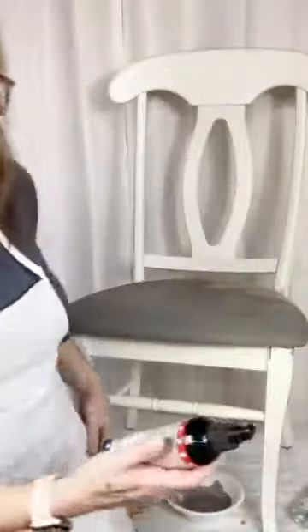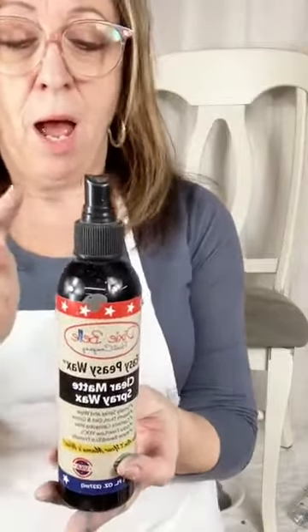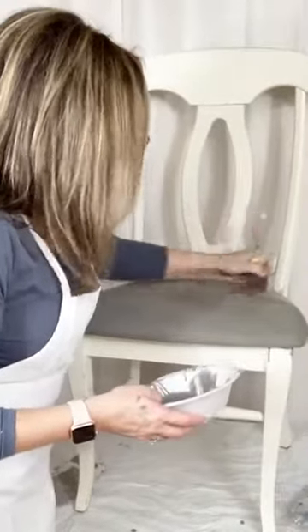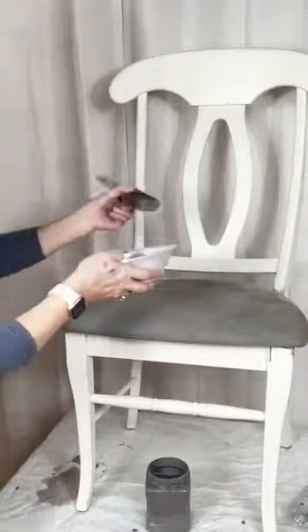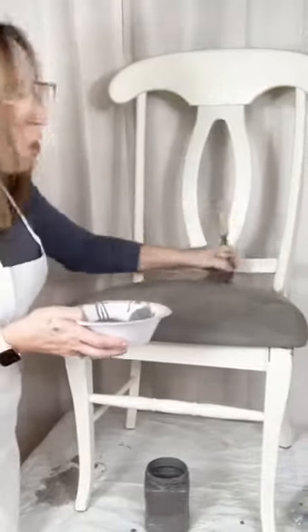How long do you have to wait with the wax before you can sit on it? Let me go over the Easy Peasy Spray Wax. It dries in 30 minutes but cures in six hours. So in six hours you can sit on your furniture and relax. The biggest thing is making sure you wait between coats of drying paint before putting your next coat on, and lightly sand between each coat so you don't have any hard surfaces.